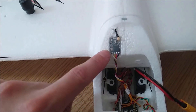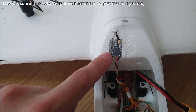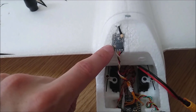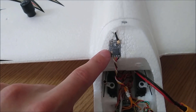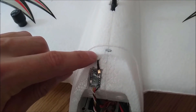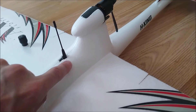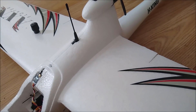The receiver, as I do on my aircraft, is a TBS Crossfire Nano receiver. This is great because it's brilliant for long range but also it's extremely small and extremely light, which is especially useful on a glider. I run the antenna through a channel and it comes out there, with the other end extending down into the fuselage — foam isn't going to block the signal.